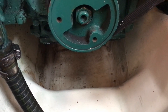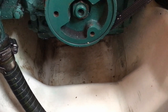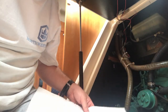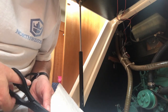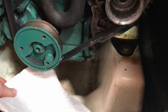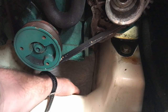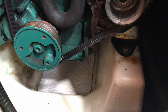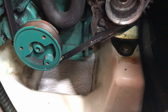Disgusting task all completed and the engine bilge is now quite clean. We put a new spill-absorbent pad in — about an A4 sheet's worth under there. Now you can see it's nice and white. Next time we look after running the engine, if there are any spots on it we've got an oil leak — nice and easy to spot.